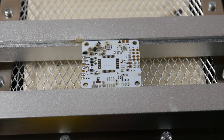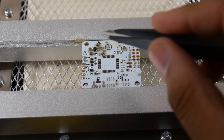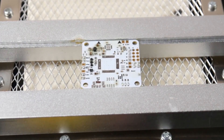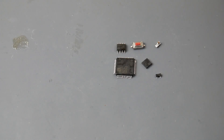The resonator was stuck to the tweezers but there we go. I'm also grabbing the BAT54C Schottky diode. There's no USB on this one; there are 3.3-volt regulators and some capacitors but you'd have to remove and measure those one by one. It's really nice to have this preheating element — it saves so much time and effort and reduces the chance of overheating the board, especially ones with a lot of copper plating.